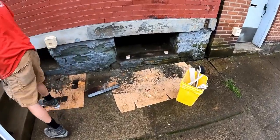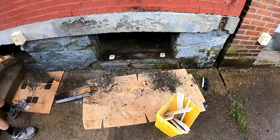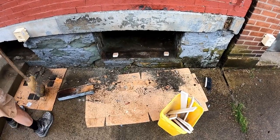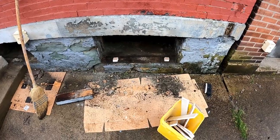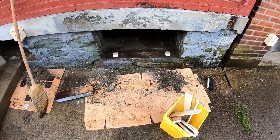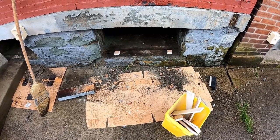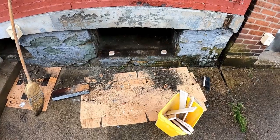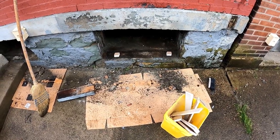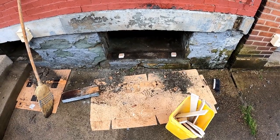As you can see, there's 2 spacers on the bottom. What this is going to do is get that window up off the windowsill a little bit and center it in the opening a little better. You can use just about anything for this. You can cut yourself some little wedges or blocks of wood. Sometimes you'll have a 1/4 inch on top or bottom, 1/2 inch, and sometimes a 3/4 of an inch around the window. It just depends on how oddball of a size the opening is.